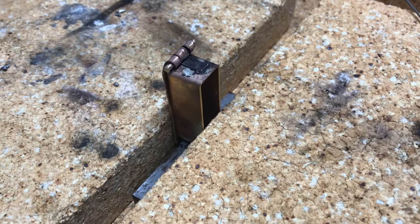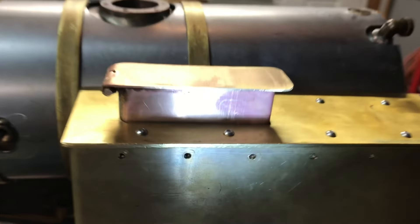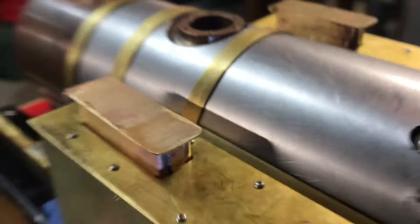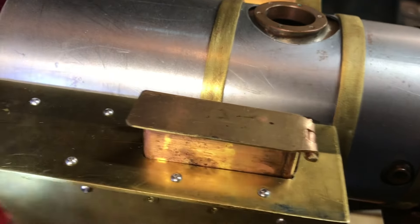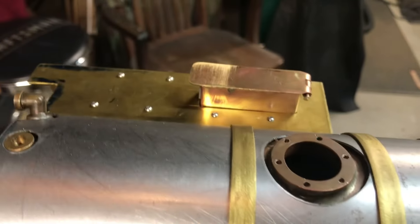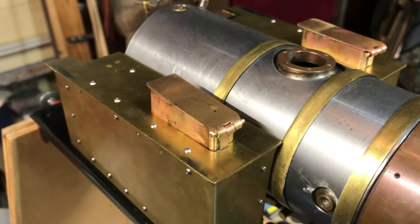This is the left-hand side — I soldered the joining piece in the back and then soldered this tab in the front to hold the hinge. I've got it set up between a couple of fire bricks. Here are the tank fillers with the lids silver soldered on — both of them done. I'm pretty happy with how that came out. The soldering is a little blobby in places but overall pretty good shape. My next move is to take the tank tops off, clean the area, and soft solder the filler into each side.